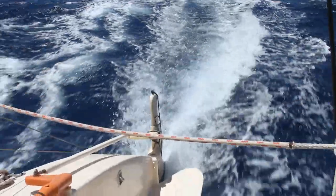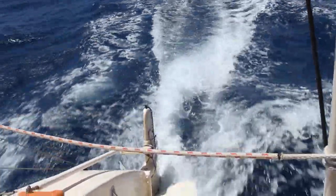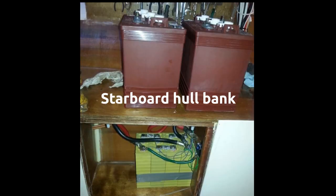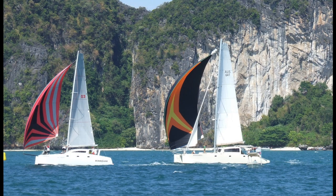Hello and welcome to episode 2. Our evolution to lithium batteries was a natural progression. In our first three years on Fantasia, we had gone through two sets of lead acids. So I was keen to give lithiums a go, replacing our second set of 400 amp lead acids with 300 amp Winston LiFePO4s, which were half the weight of the lead acids. This smaller bank proved so much more powerful and our power needs were happily satisfied without variation for nine great years.